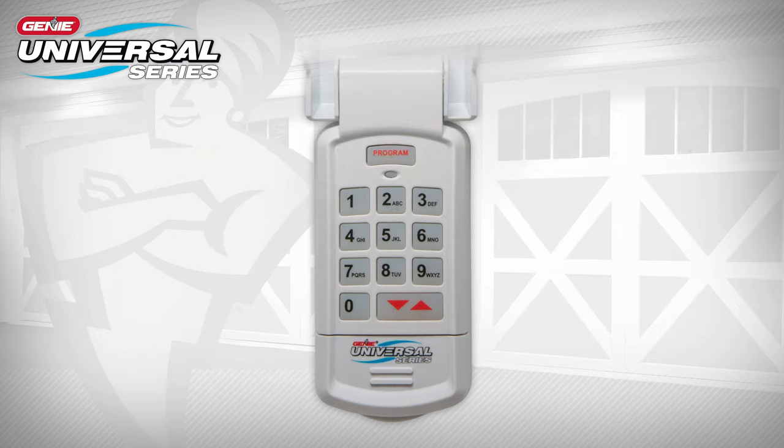With the keypad backlighting off, press the program button 2 times for the second opener or 3 times for the third opener. The blue LED will flash slowly. Press the number 4 button and then press and release the up-down key. Now, press and hold down the up-down key for about 5 seconds until you hear a tone, and then release.